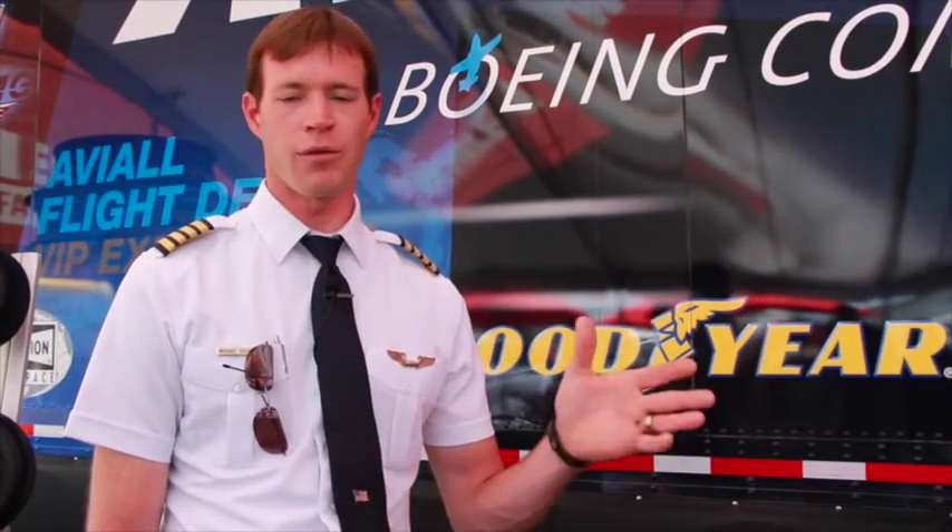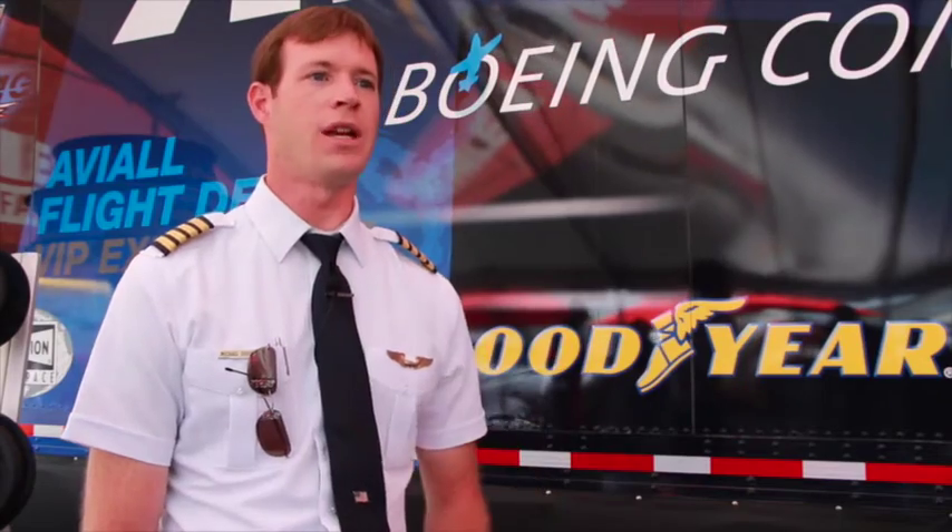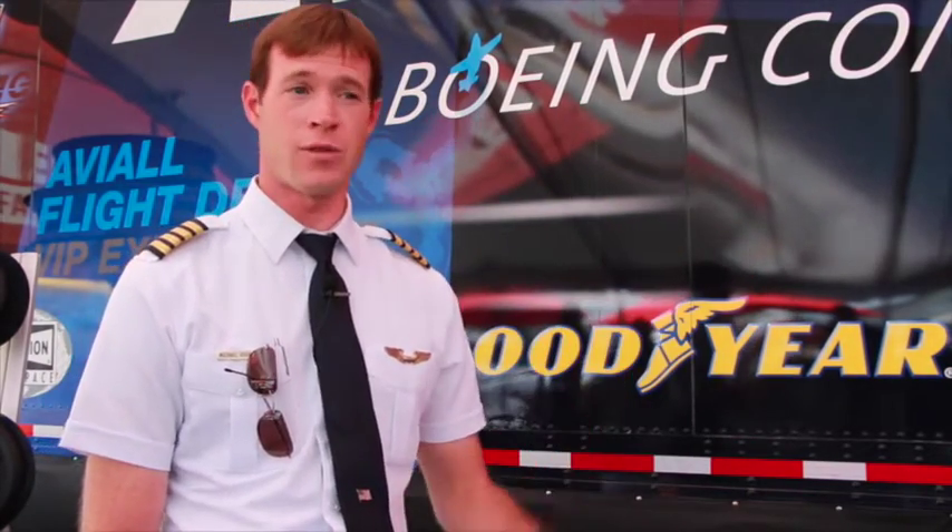In an airship, we don't rely on our engines for lift — a great majority of our lift is in the helium, which does most of the heavy lifting. We rely on the engines mostly for forward airspeed to get from A to B. Because of that, we can run engines at much lower power settings than your average airplane. We routinely fly our airships in the 28 to 40% power range, which allows us, even with 200-horsepower engines, to run three engines at about 11 or 12 gallons an hour total fuel burn — significantly less than what you'd see from a similar engine in an airplane.